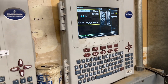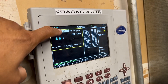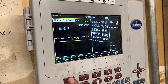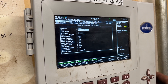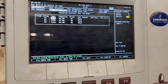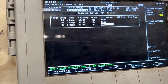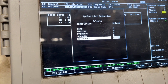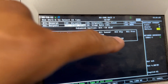Now we're going to program the board into the controller for Compressor 3. So we sign in. Once we log in, go ahead and go to your Suction Group, go to Setup, and then go all the way down to your Stage Setup. Then once you're in Stage Setup, select your compressor - ours is number three - go to Oil Sensor, and select Close OK, and then the 10-second timer will pop up.